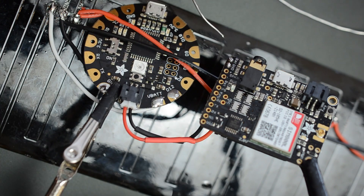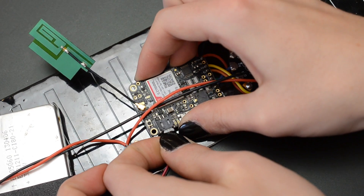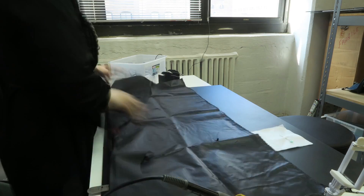This wiring configuration takes advantage of Fona's onboard USB Li-poly battery charger. But it does mean that either a battery or USB power must be connected to Fona even when Flora is plugged in for USB debugging. Fona can't be powered from Flora's USB port.